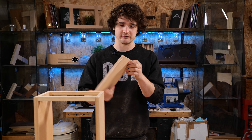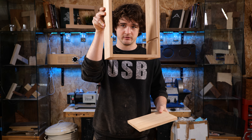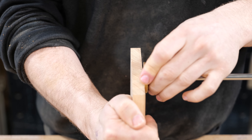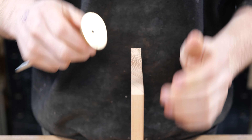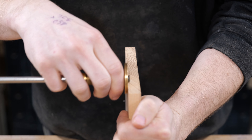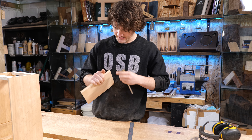This setting is going to be scratched around all four faces of both sides. The shoulder lines have been marked out. The next thing to sort out is the thickness of the tongue, which is going to be 10 millimeters according to the width of the groove cut into the cabinet. We're working on a 15 millimeter thick component, so I've set this marking gauge to 2.5 millimeters — therefore taking 5 millimeters off the overall thickness and giving us a 10 millimeter tongue right in the center. I'm also going to continue those scribe lines down the front to meet up with the shoulder line.